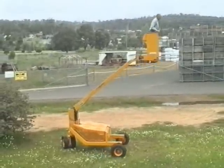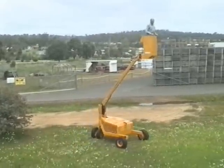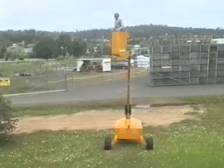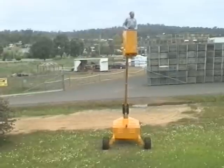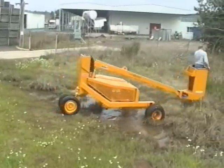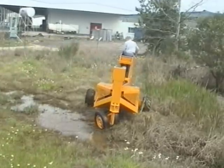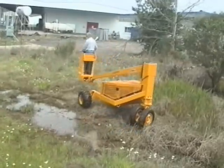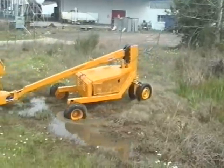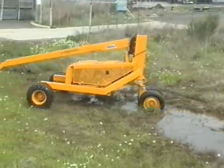The 505 model has the same engine compartment as the 805 and 655 models. The standard cage rotates 120 degrees — 60 degrees to the left and 60 degrees to the right. The 505 and 655 models both have a caster wheel with two tyres and an additional horizontal pivot to provide a smooth ride over uneven terrain or street curbs. These wheels greatly reduce the possibility of bogging because of their independent rolling action.